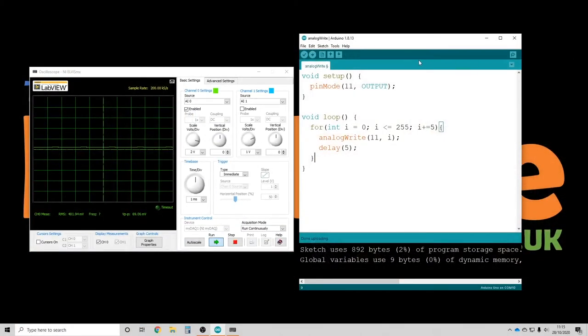Let me go to my full desktop. Let's send this over and see what it does to our output. Uploading - and we've got a wiggly line, so let's set the trigger on our oscilloscope. That looks pretty good. What's actually happening is the voltage on the output of our capacitor is increasing as the for loop increments. Once it reaches 255 the loop exits, nothing else runs, so it comes back to the top and sets i to zero again - that's why it suddenly drops off. The capacitor doesn't discharge too quickly, so it goes down slowly, and we can see a nice simple ramping analog output from our Arduino.